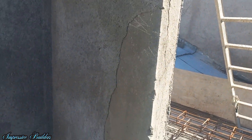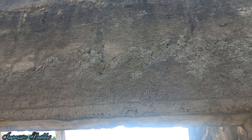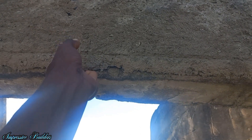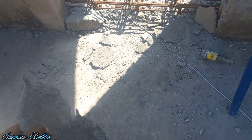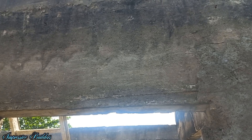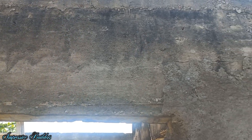All right guys. So as I said before, all the lintels that are rough cast are hollow — soffits are the same thing. So ensure you get your hacking process into consideration, or bonding agents. So you don't end up with costs in the future, having to dig down back your house and redo it because of poor workmanship or poor materials. This lintel is also hollow — look at that, all the rough cast falling apart. Concrete is too smooth, or it was rough cast when the temperature was hot, so the mortar separates from the concrete. Ensure that you wet it to keep it cool. All right guys, I'm signing out this video, see you guys in the next one.